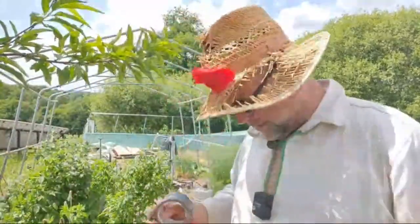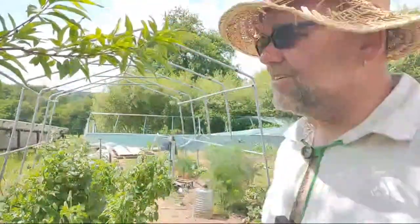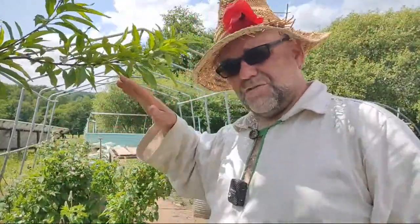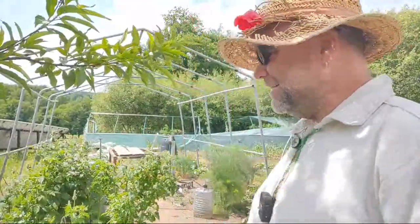I chopped some of the bottom base bits down, they had a bend in them, so I've basically driven them into the bends. It's almost like it's gone in like a dovetail. So yeah, I can pull it out. I tell you, it's hard enough getting them in the ground. It's that deep. So what I did is I cut them to length, and then I bashed the ends flat, and then I drove them down with a block of wood and a lump hammer.